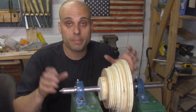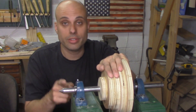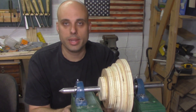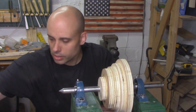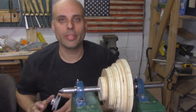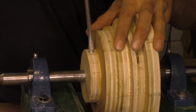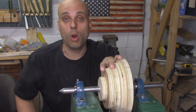This project is moving right along. Here's my lathe headstock, and you can see I've mounted the cone pulley that you saw me make earlier in the video. The process of getting the cone pulley onto this three-quarter inch shaft was exactly the same — I got a three-quarter inch spade bit, ground it down a little bit, drilled the hole for a nice tight fit, and pounded it on. Then I realized that this shaft doesn't have a keyway in it and I don't have any spare keys, and a tight friction fit isn't going to be enough. Looking at my commercially made pulleys, the ones with a hub also have a set screw on the hub. So I added two additional pieces of plywood on each end to act as hubs, drilled them out, and ran in regular wood screws with the points ground off. I think these are going to work really well to keep everything in place, especially with the tight friction fit from drilling the hole a little undersized.